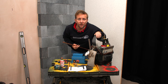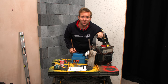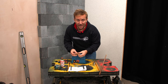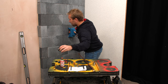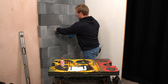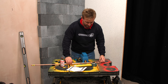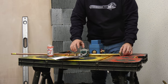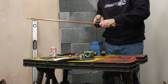By the way, all the tools I use, consumables, everything in this tool bag and every other tool bag that I've ever used on this channel, you'll be able to find in our Amazon store as well. For this side piece, it's really easy to figure out. I can just pop this on like so, and I want the centre of my outlet to be on the centre of this mark here, 14cm. So I just lay this pipe down, look at it from above — very easy for me to set that on the centre there. There's our 14.2 centimetres just there, which means I can accurately cut this.